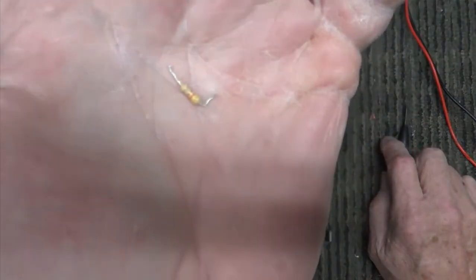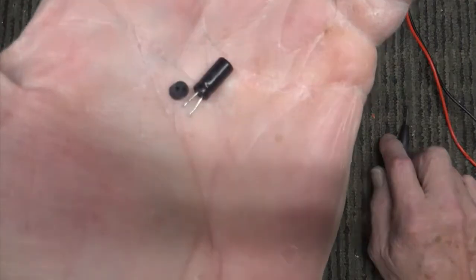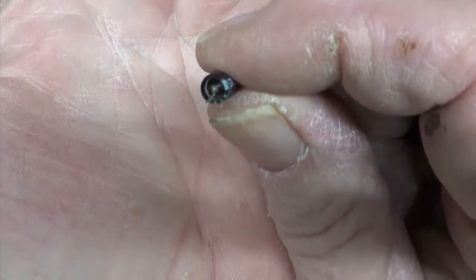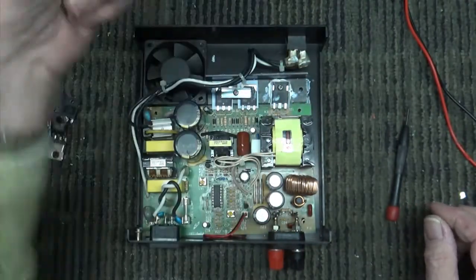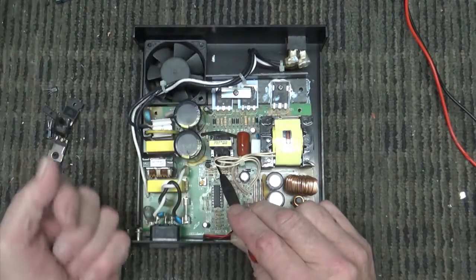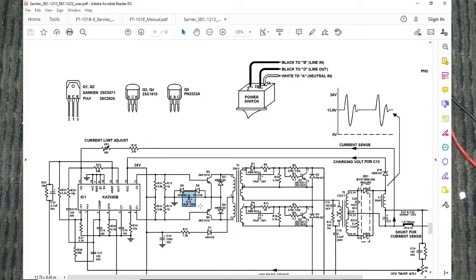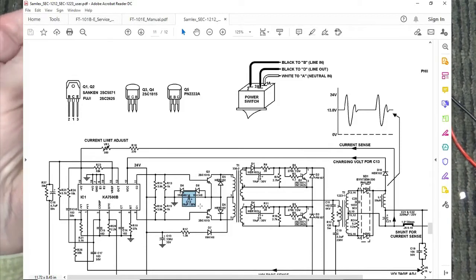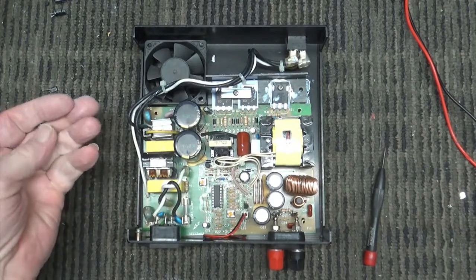In order of appearance of blown components: first the 4.3 ohm resistor was blown. Next, a capacitor — if you look at it, it blew the entire plug right out of the bottom, so it's just open — no connection. Another capacitor, back here, which on the schematic is right there — that 10 microfarad at 50 volt cap — has very high ESR, something like 25 ohms.